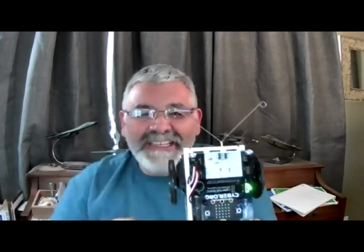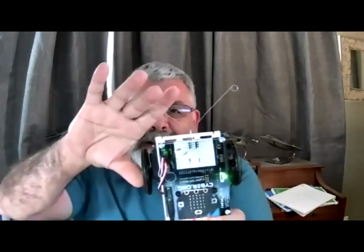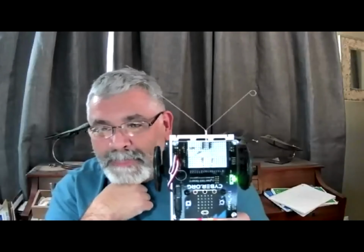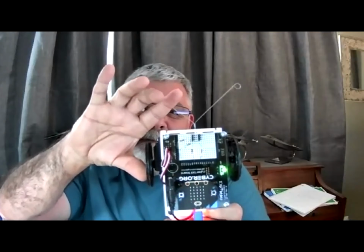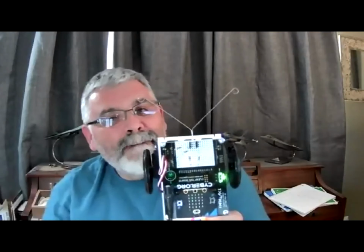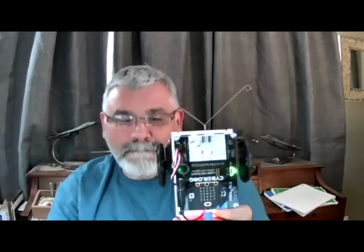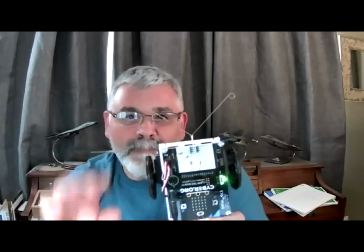That's really good. And so what I want to point out about what you're showing is you're using the LEDs as visual feedback really nicely. Always try to do this. You have a bunch of LEDs for free and they can show you where in your program your robot is while it runs. You got numbers, shapes, levels, anything you can fit on there. And there's also a speaker, which we've not used. So the speaker could be used in that way too. And further, the MicroBit 2.0 has a microphone on it, which should serve some purpose for robotics. Very cool.